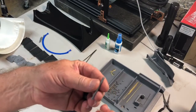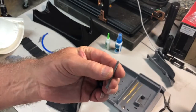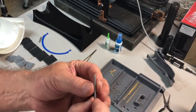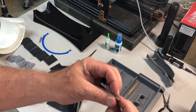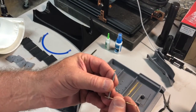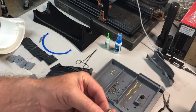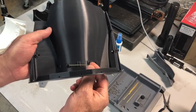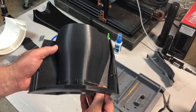For the drag links, I highly recommend printing them on a small raft. These things don't have a lot of surface area on the printer bed, and if you don't have the exact right squish gap on the print nozzle, the overall thickness will suffer greatly. Printing on a raft pretty much solves all those problems. When they finish printing there isn't much of a hole in them — they take quite a bit of work to open up. I was afraid to open the holes too much in the STL because different printers function differently. Also don't forget to check the hinge points on the stationary cowl — they want to slide freely but without a lot of play.